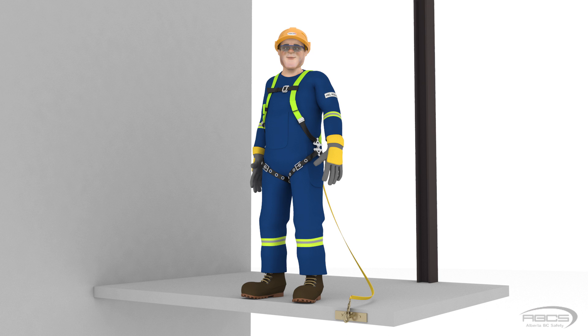If Abel were to fall from this position, he would fall the 5 feet to be level with the anchor, and continue free falling the entire lanyard length of 6 feet until the lanyard is hanging straight down from the anchor and is pulled tight. So essentially, you must add to the lanyard length the distance that the anchor is below your D-ring.